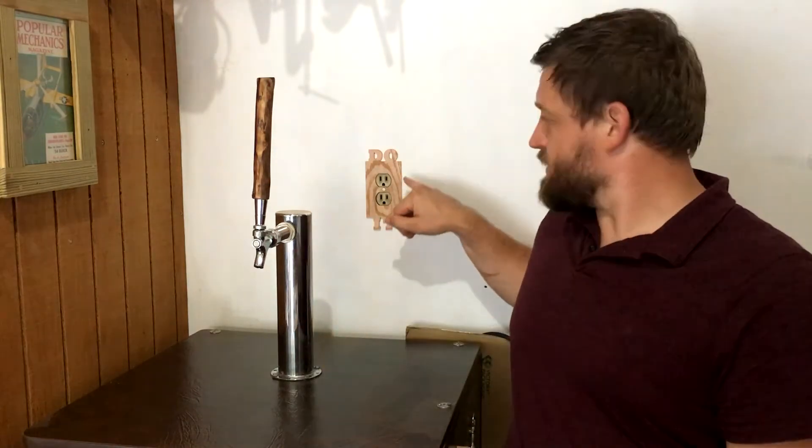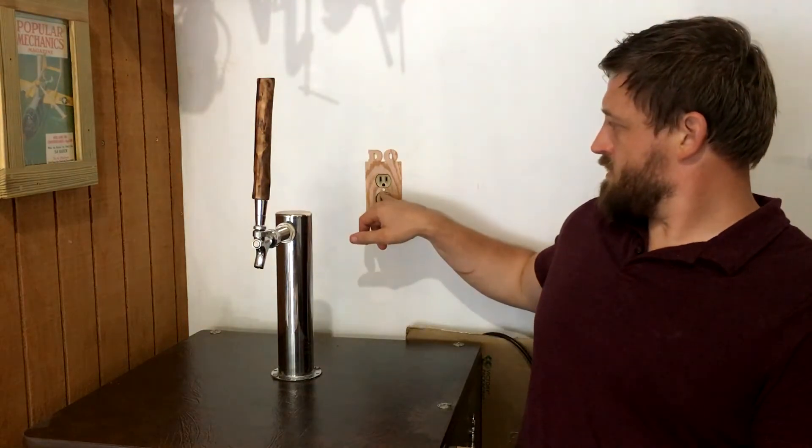One thing I was planning on doing and then ended up not was adding a chamfer, either with my hand planer or sander, to the side edges here and here. I ended up enjoying the way it looked as is and left it that way. One thing I did do off camera was add a countersink on my drill press — using just a countersink bit I recessed the material so the head of the screw would sit a little more level with the surface, like a common electrical outlet wall cover.